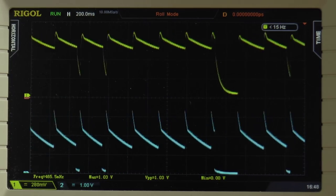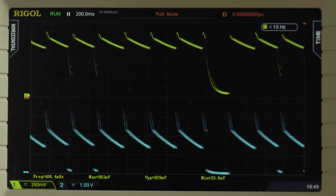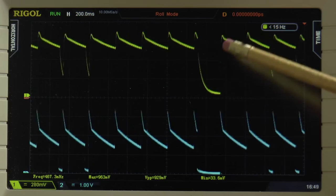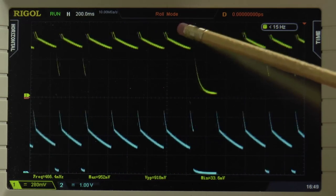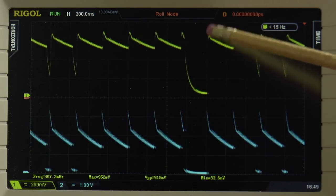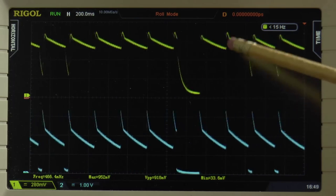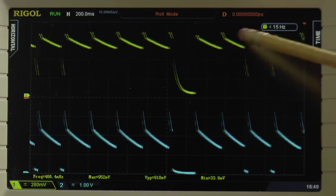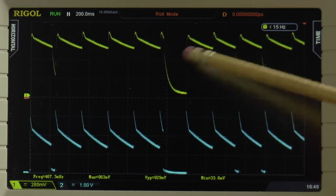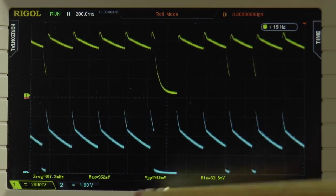And again, I don't know if you can hear it on the tape, but all of that is gone now. There's no sound coming out of there. You'll notice that the wave shape is much more modified up here. Now the little crown there, the sharp rise and little bit of fall, has gotten much more rounded and smoothed out. These drops to zero, those ones aren't even going all the way to zero anymore. So the waveform is much more modified, but it has eliminated everything.